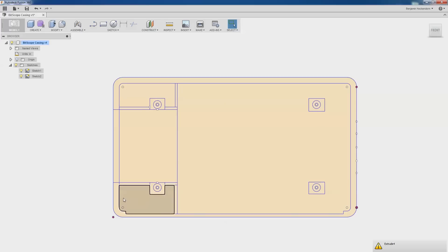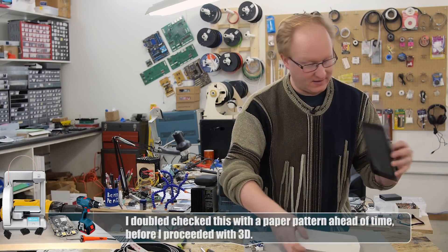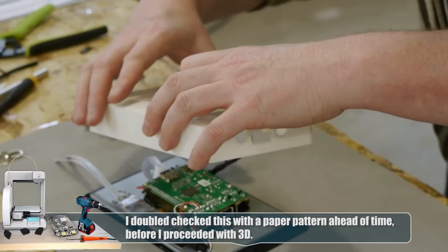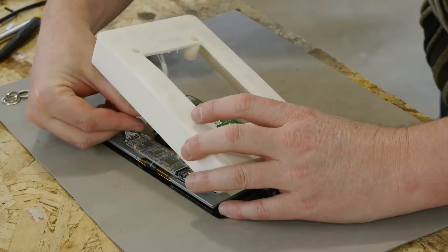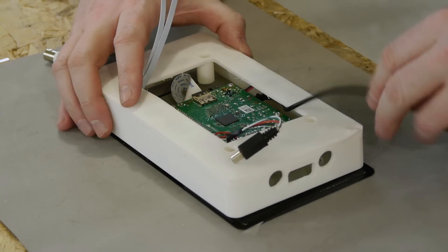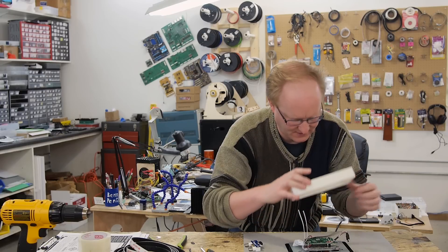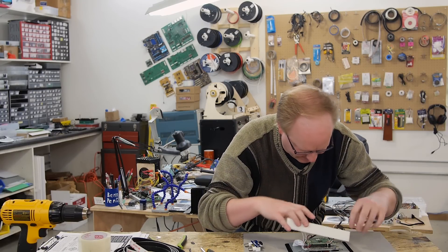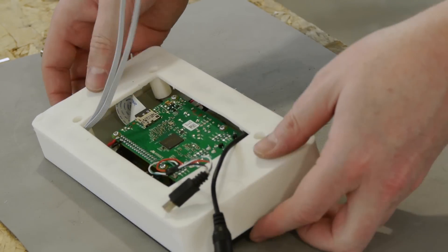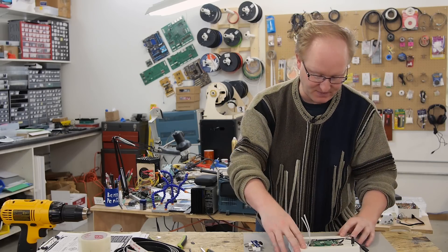I have the four basic positions of the screw mounts as well as the shape of the glass bezel itself. I'm going to print out a rough casing just to make sure it's right. Here's a test case I printed out — it's a little rough but it's just to give us a reference. This should fit here. I'm thinking the rear of the unit can just push right up against the glass, so we don't have to actually enclose the glass — we just push up to it and then attach the mounting screws. We'll have a back panel like this, push up against the four mounting spots, and drop M3 screws through here to attach the panel to the glass.